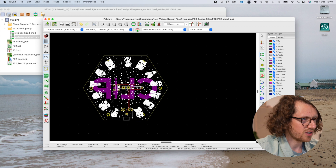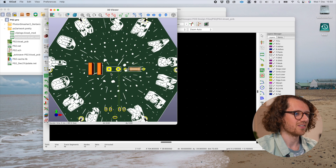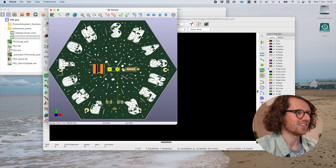Let's get rid of this graphic. Here we go — nice. And now for the magic trick. So with the artwork done, now I need to look at making a few of the other changes. I need to move the footprint of the jack on the bottom closer to the edge, and then I need to export these ready to be sent off to be fabricated. The next time you'll see these circuit boards hopefully is me opening up a box and we get to see what they look like in person and start assembling them. Fingers crossed I can remember how to export them because it's been a while.